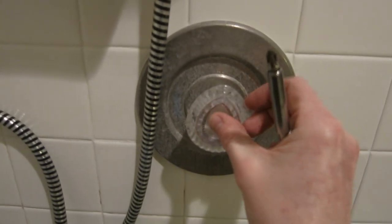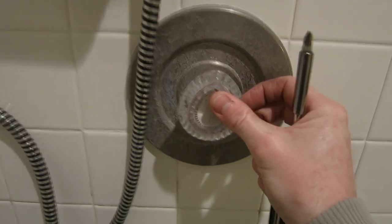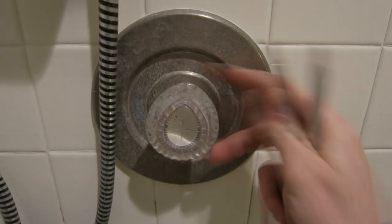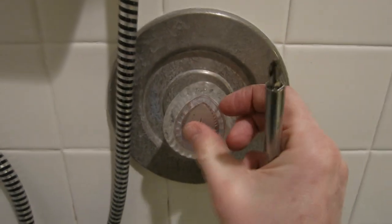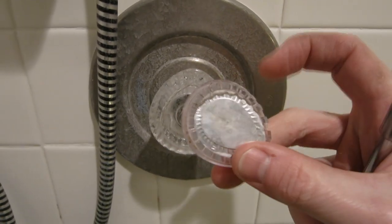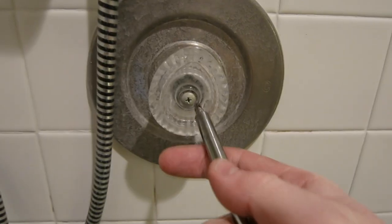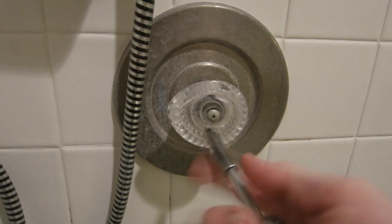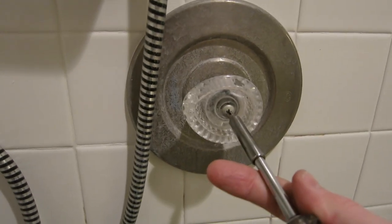With this type of shower unit, it's just pull out for turning on — right is cold, left is hot. Right here, you just dig your fingernail in and you'll remove your cap. Or a flathead screwdriver can remove that. And then we see a Phillips head screw right here — a nut, I should say. I'm going to use two hands and go ahead and remove this.